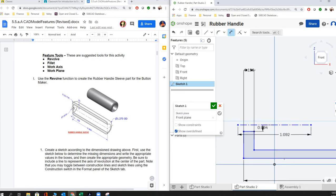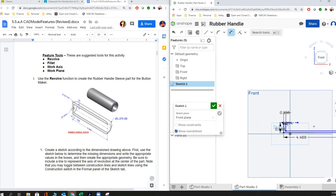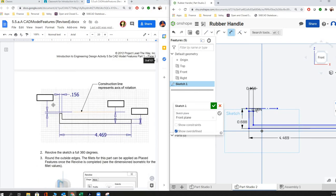We'll bring that down, then go from here down to here for our outer diameter. Remember, we want half of that outer diameter — the radius. We say 1.375, pulling that number from the drawing, but we're only dimensioning halfway across, so we divide that by two. The last measurement we need is the thickness of that wall, from here to here, which should be 0.25. We're not dividing this one by two because it doesn't cross over — it doesn't double up when you revolve it.